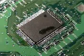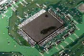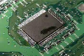When you've got one side tacked down, take a magnifying glass, place it over, and check in between the pins to make sure there are no shorts. What I like to do is get it right over and shadow the light so that the metal and the soldering flux don't give off a reflection. Soldering flux a lot of times will look like metal, but by shielding the glare you'll be able to see whether or not there's actually a short. Then take a hobby knife and press each pin.